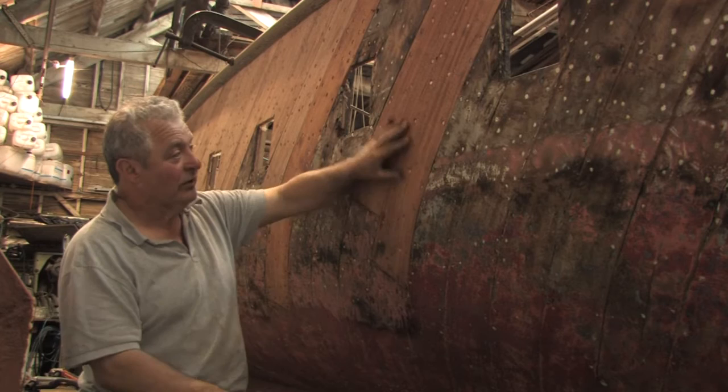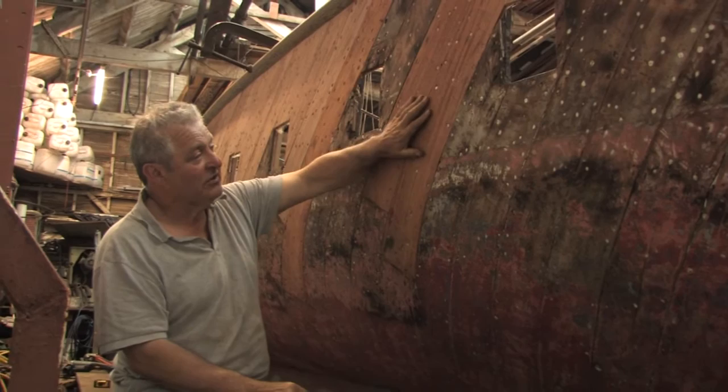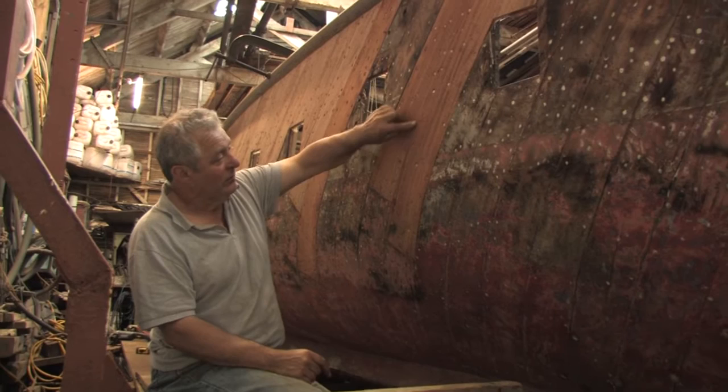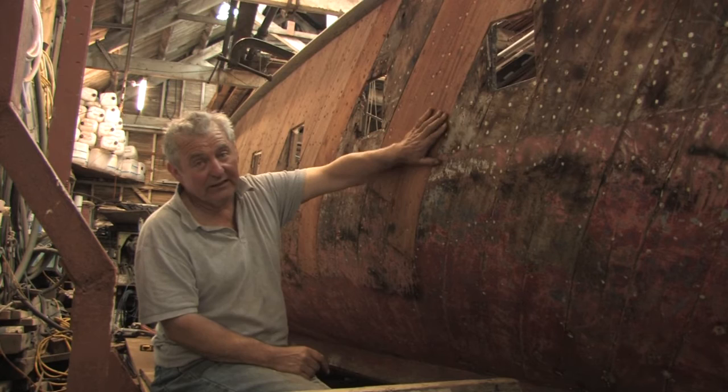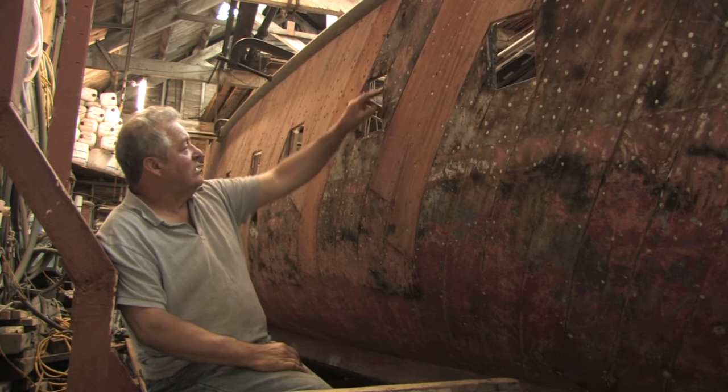After it's settled down on the nails, we'll get a plane, we'll dress all this off, plane it into level, then it'll be sanded, then it'll be brushed down, and there'll be a strand of cotton goes in the seam, and then there'll be a filler goes over the top of that, and then we'll do paint and prep, and there'll be several coats of paint on it and lots of sandpapering in between. This area here, there's a little bit to be cut out there when we get the fittings.